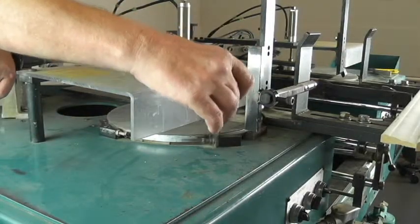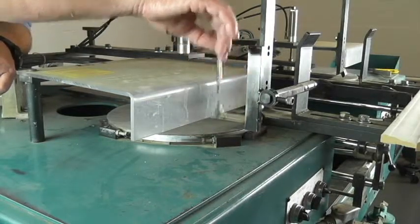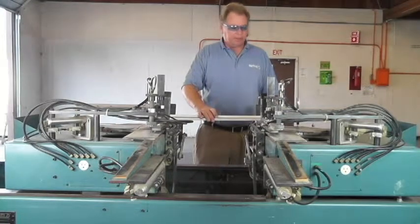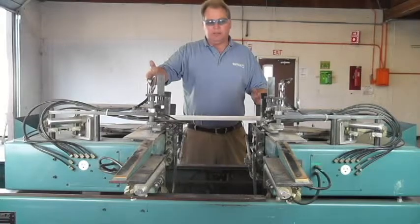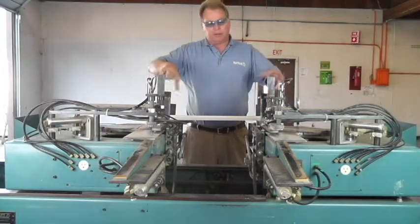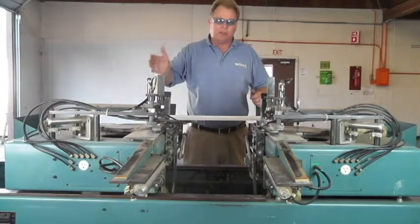Now that the 90s and the 45s are both looking pretty good, the next thing is to cut a short length — with a 45 at one end and a 90 at the other. Then without changing the length setting of the saw, rotate the two turntables so you have a 90 at one end and a 45 at the other, and cut a second piece.